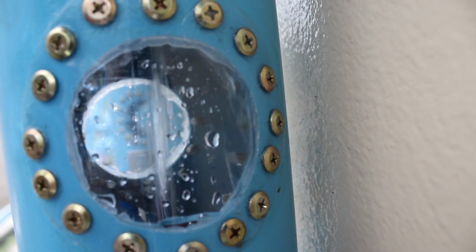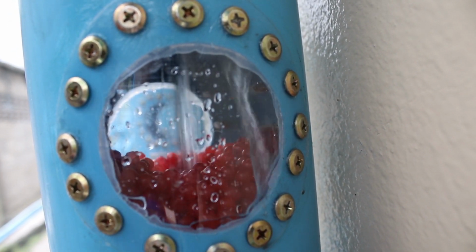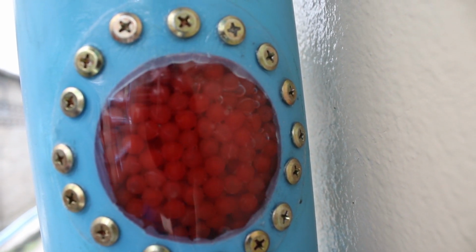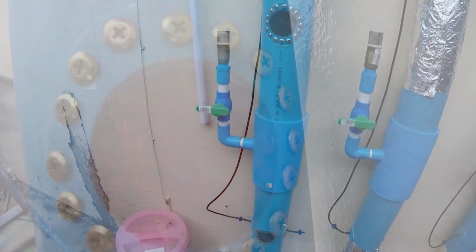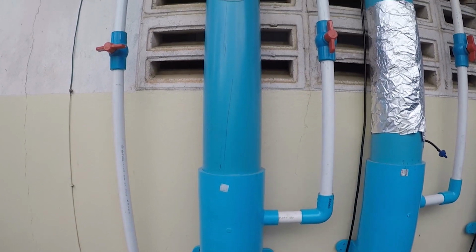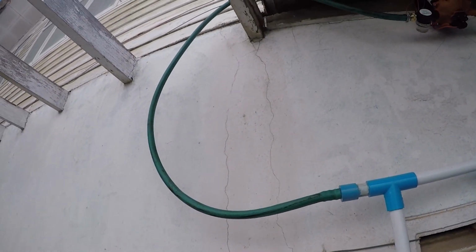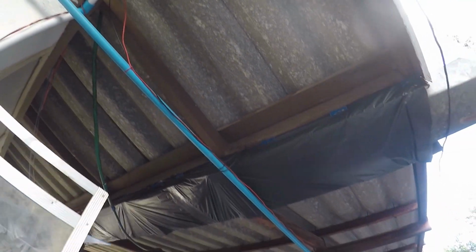As the tubes are filled with wastewater, the beads are forced to the top, requiring the circulating water to pass through them, forcing the biological reaction that feeds the aerobic bacteria living on the surface of the beads. When the wastewater has completed its cycle through the biotubes, it is directed back to the waste capturing system for reprocessing. The wastewater is recirculated until it reaches optimum levels of macro and micronutrients, as well as removing harmful elements.